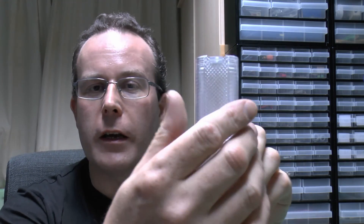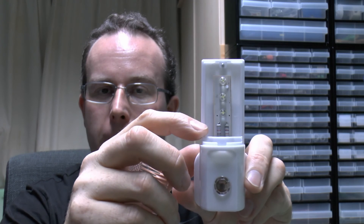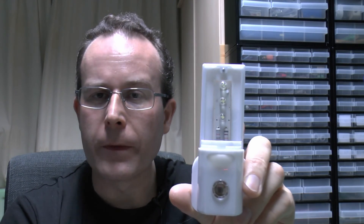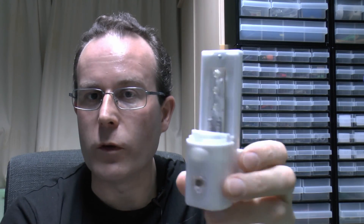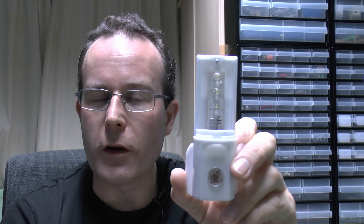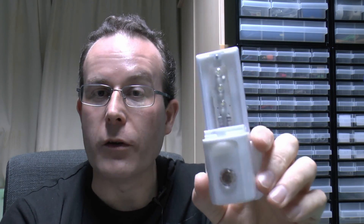So that's the wasteful little night light. Normally it would be used in this position here, and inside the two resistors are actually here in the centre of the circuit board. Because all the heat from those is going to rise and cause those three LEDs above to heat up, and that's going to shorten their life considerably. Although for a 99 pence device I doubt anyone will actually be complaining. The major problem here though is it's just a 1.5 watt heater, throwing away energy for no reason whatsoever. Although 1.5 watts isn't a huge amount, and even if left on permanently it's only going to be 2 or 3 pounds a year in electricity costs, it's still 2 or 3 pounds of electricity which does not need to be used, particularly considering there must be millions of these things out there in use, so overall it adds up to a fairly significant amount of wastage. Until next time, thanks for watching.